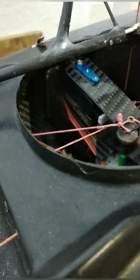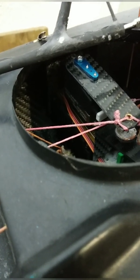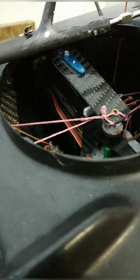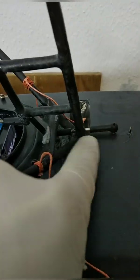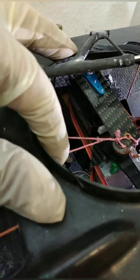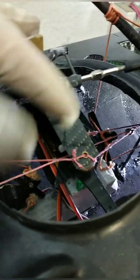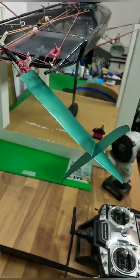Going inside the boat — this is, or shall I say, this was the servo I wanted to use. Sadly I burned it up; I think it's because my pulleys have no ball bearings. In the front we have another pulley connected to a vertical rod which also stiffens up the whole mast system. This servo pulls a rope in either direction. Let's move it by hand — as you can see, moving it gives the rudder a good angle.